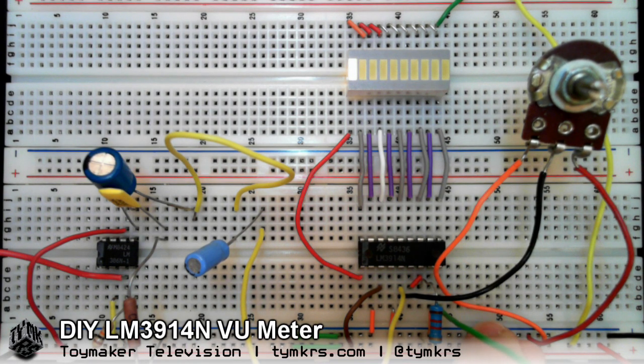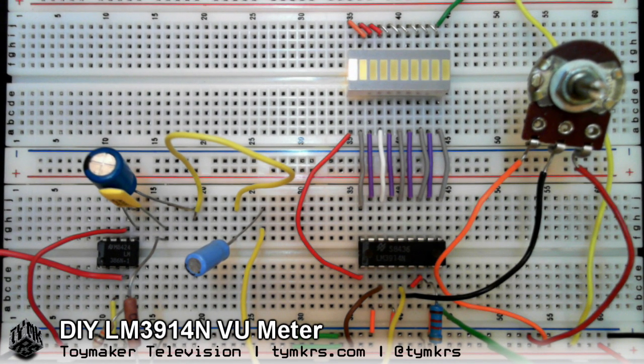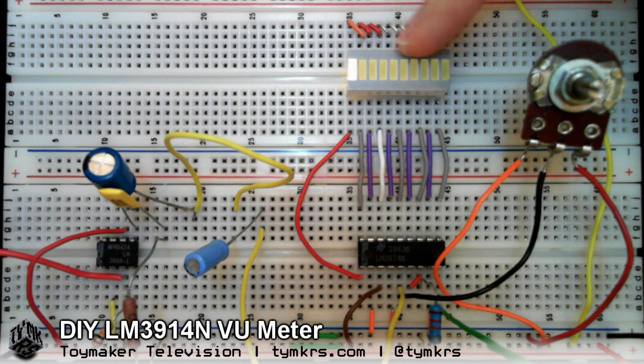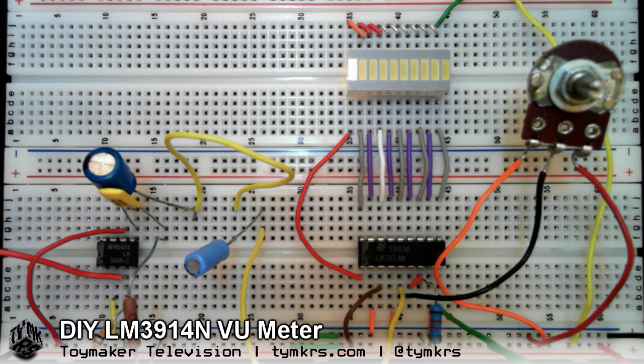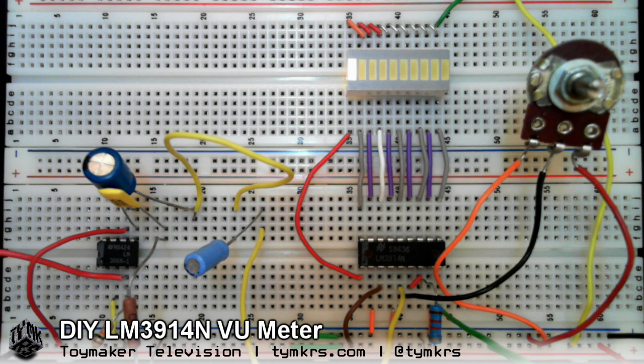So let's move that back to bar mode. Yeah, I actually learned quite a bit of interesting stuff about pins and what they do, and also about how to use voltage dividing trees and how these chips cause LEDs to light up in succession. This LED bar is just a nice package for 10 LEDs — you could easily substitute 10 individual LEDs instead of this bar. Or 10 Nixie tubes being controlled through relays, you know — you can go as crazy as you want with your display. Just the chip is doing the heavy lifting there.